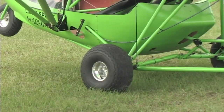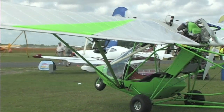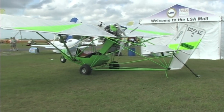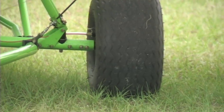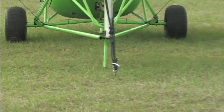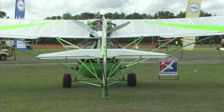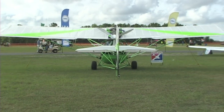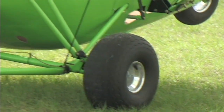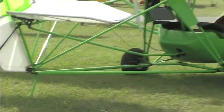You've got a four-stroke versus a two-stroke, so you have less vibration and prop speeds are down even more. We run this at 5,200 wide-open full throttle and cruise in the 3,200 to 4,800 RPM range. The two-stroke is 6,500 down to about 5,000 — so your cruise RPM at 5,000 on a two-stroke is almost the maximum RPM here. You've got a weight saving of about 100 pounds.